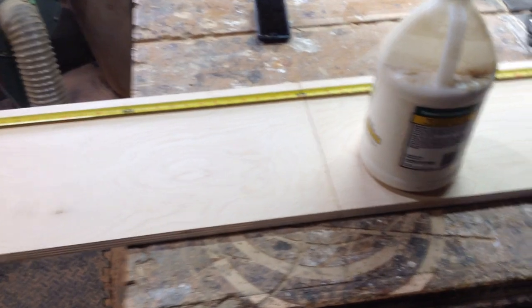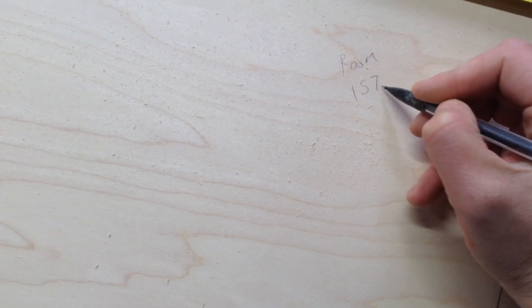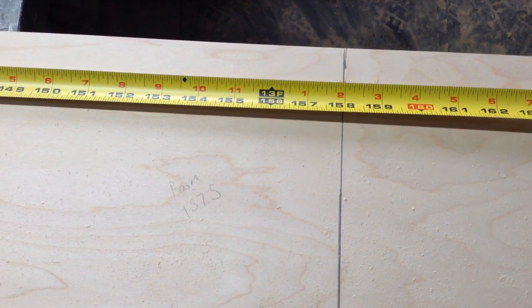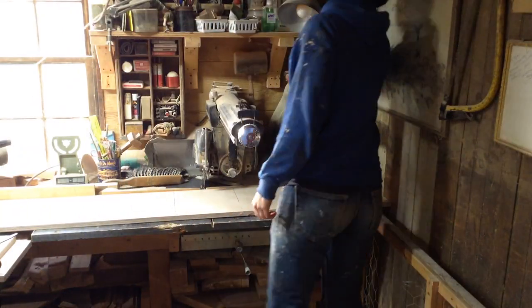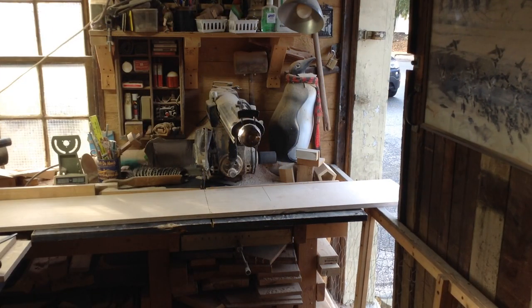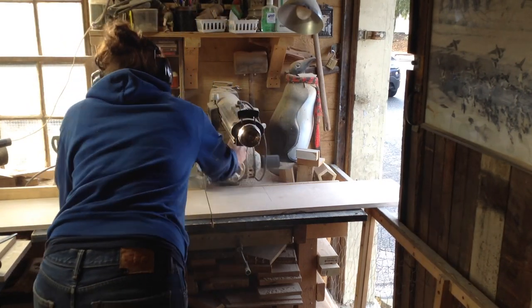It's just the same thing, three quarter inch birch veneer ply. It's going to be a little shy of the ceiling by about an inch because I'm putting crown up top, so I'm giving myself plenty of play. The ceiling is one of the places where you'll usually encounter changes in dimension, so you want to give yourself some play up top. And then as you can see, I'm a little over 13 feet because the room is 157 and a half. So I'm going to cut this right now at 158. All these panels are going to be trimmed down in the space, but I'd rather leave them long just in case I mistook a measurement. So this panel is going to be a little bit long.